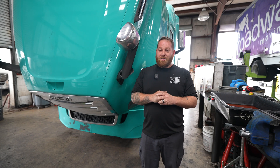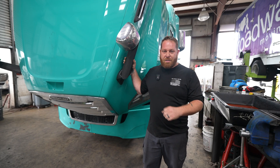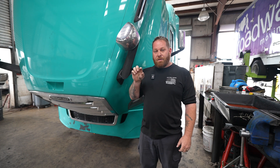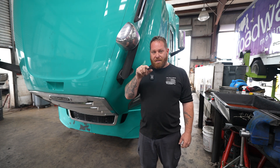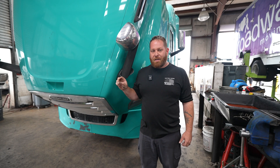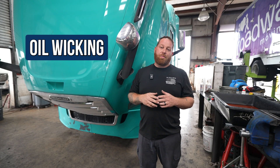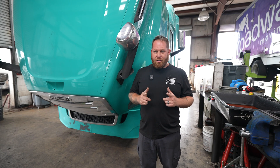So today we're going to talk about this Freightliner Cascadia right here — about an oil pressure sensor, which is on the block. You normally see it leaking. The good news is I have a truck here so you're going to see what it looks like. We're going to replace it before it gets worse, because you can have oil traveling down the electrical line, which is called oil wicking. You don't want that because then you'd have to replace the harness, which costs money. So if you can catch it before that happens, kudos to you.